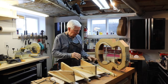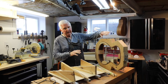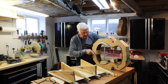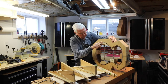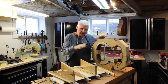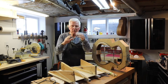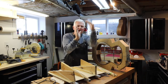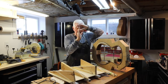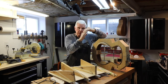Okay, we are back. One of the things I have done already is I've put the radius on the front and the back of the guitar. The guitar will be shaped like a dome going this way and a dome going that way. What's important is the radius dish — I have 60 grit sandpaper on it and I use that to put the angle on here, so that the top comes down and you get a better glue joint, and that's really important.